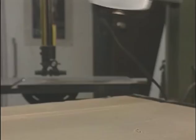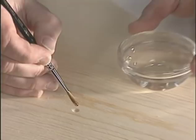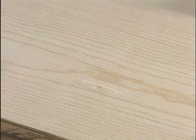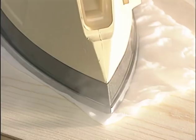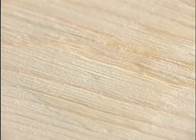We'll need some clean water, a fine artist's brush, and an electric iron for clothing — it doesn't have to be a steam iron. With the brush, put a few drops of water directly into the well of the dent and let it soak into the wood fibers. Add another drop or two to fill the dent with water. Wet a clean cloth and wring it out so it's damp but not dripping. Lay it over the water-filled dent and press the hot iron over the spot. The hot iron turns the water in the wood to steam, which rapidly expands, pushing the crushed fibers back into their original shape. Reapply the iron until the fibers stop expanding or until the rag is dry. Now it's flush enough to sand smooth.